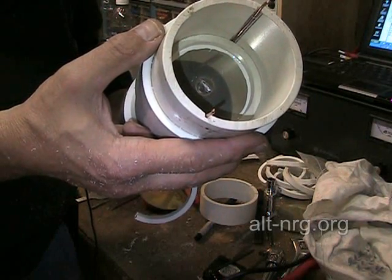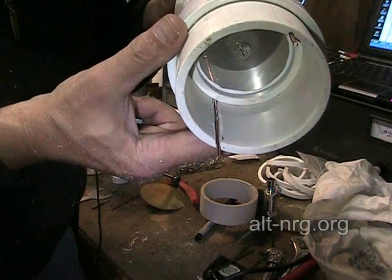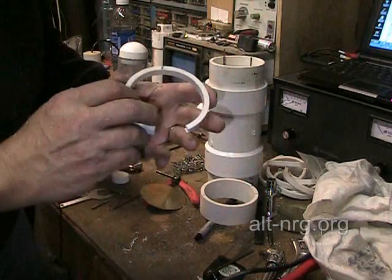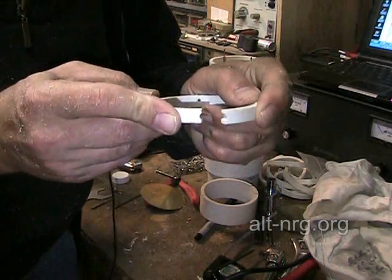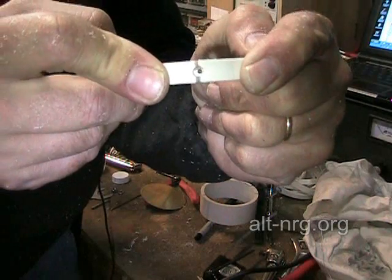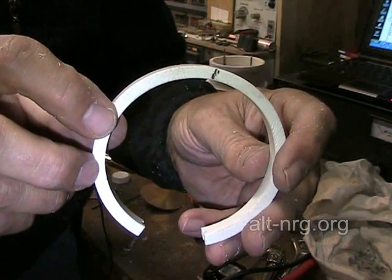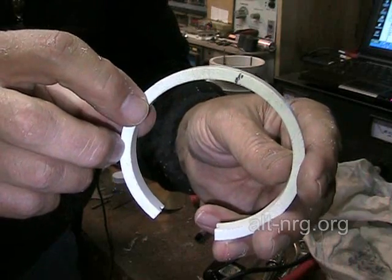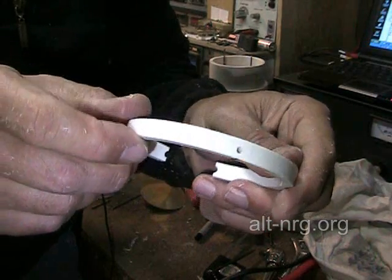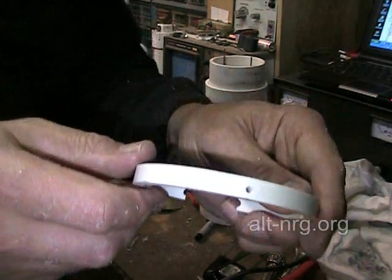I still don't have a way for the gas to exit at the top into the channel, or for the electrolyte to enter at the bottom between the plates. So what I did was take one of my C-rings and cut a notch with my Dremel tool so that where they meet creates an opening down to the channel. At the top, I drilled a small hole that I marked with a sharpie after inserting it into the tube and locating exactly where it needs to be — so that when assembled inside the 3-inch pipe, the gas will have somewhere to escape into the channel that joins the chambers together between the plates. Unfortunately, that means I do have to pull this one back out and start over.